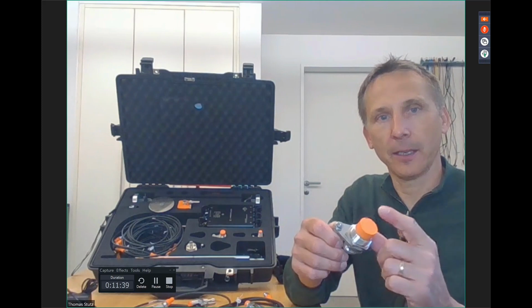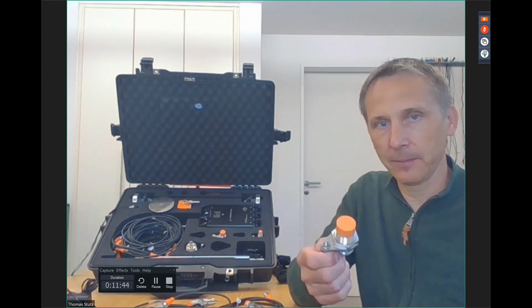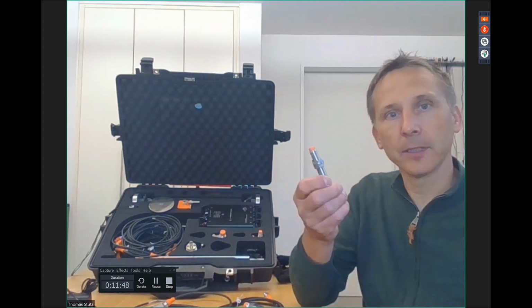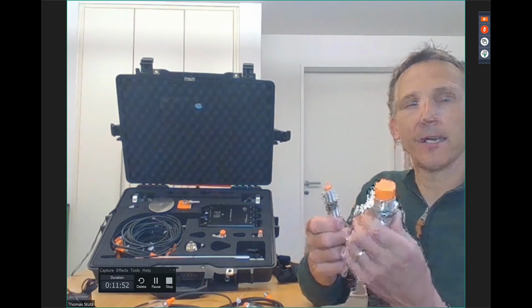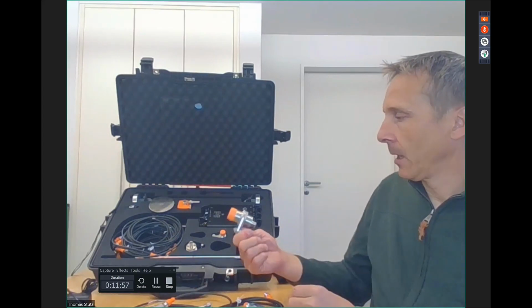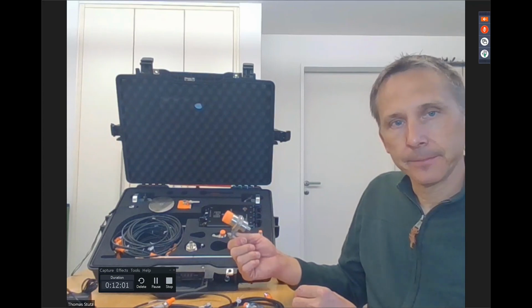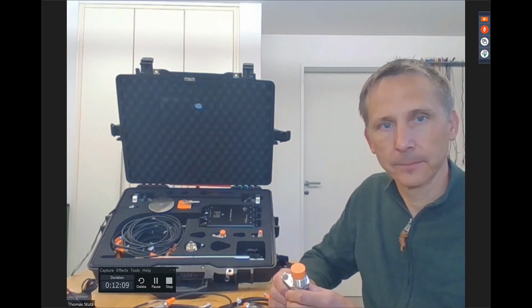We have the sensing range. Everything which is further cannot be seen by the sensor. So that means when we have a smaller sensor, the range is even smaller. That's why we have different sensors to cover different distances. So Thomas, you said the sensors are different sizes because of the measurement range that they have. And I think you said robust.